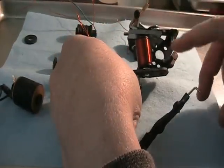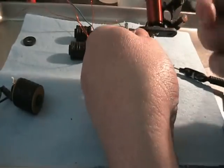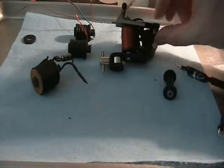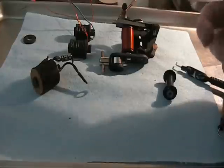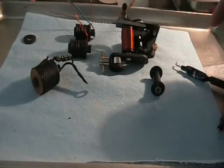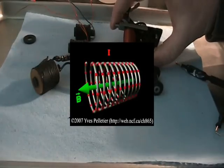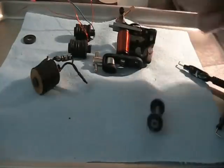If you take out your rear coil and leave the front coil, you don't need that second post. Some people call it a ghost coil — usually you'll see people wind a really big fat front coil and then put like a bar in the back, what might be called a ghost coil. I'm not quite sure what the point is, because I think it goes back to the idea that the machine uses an electromagnetic horseshoe magnet. But in reality it's not, because both coils are wound counterclockwise, and the winding directs the flow of energy in the direction of the pull. With it wound counterclockwise using the left-hand rule, your pull goes down, north to south — so both coils are always pulling down. It's not as if you create a horseshoe magnet. It's pointless, because the rear coil does so little work due to all the resistance.